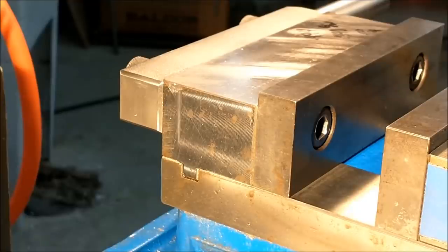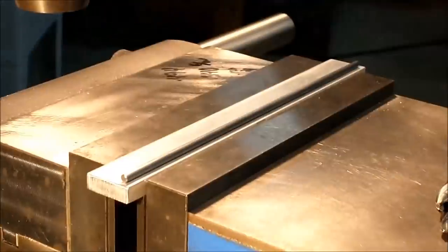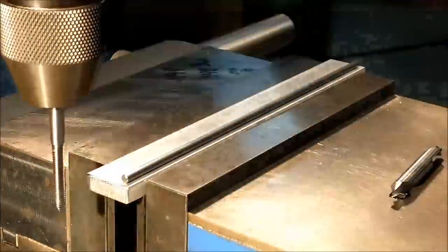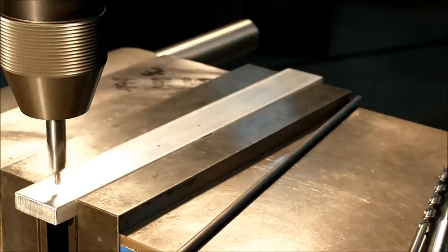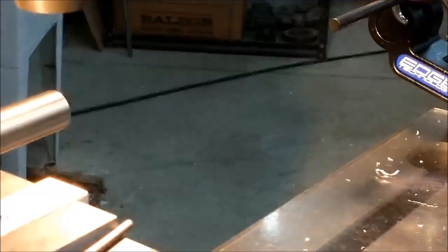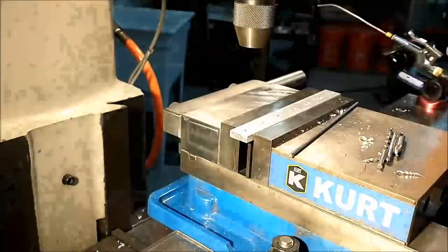You can make the screws any size you want. Just make sure they're biased to the part side and not the back side — which is what I'm figuring out right here. I'm going to put a tap in this chuck and just visually line it up to make sure I have enough room. That's a 10-32 tap, 0.187 diameter — approximately five millimeters. And yes, that is a center drill, not a spot drill. I use center drills on everything except the CNC. I spot drill the CNC.